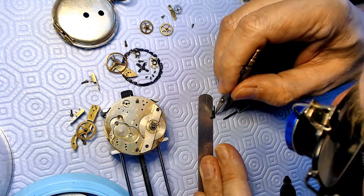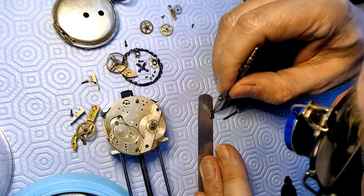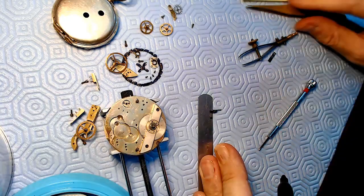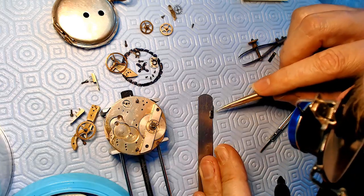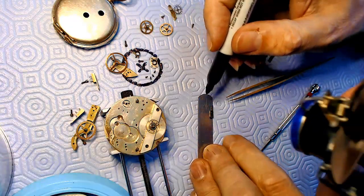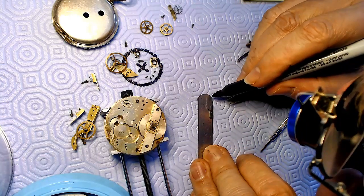I'm a better watchmaker than I am a machinist. This measuring tool is magnetic and it's starting to stick to the metal, so I need to put it through a demagnetizer. I need this to stop right about here, and then it's going to go right to the end. My thickness of this metal - I'll check when I file it down - is probably about as thick as that dot. So that gives me an indication - I cut to here and then cut it all the way to the end.